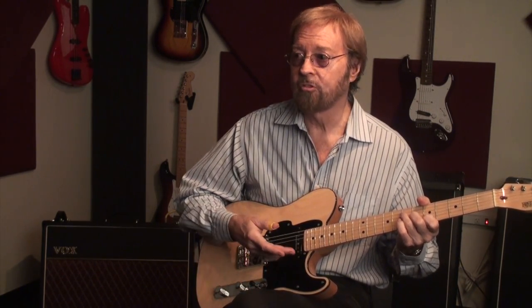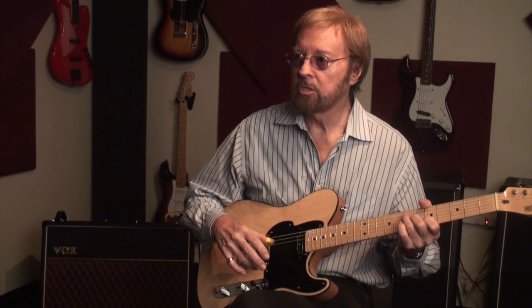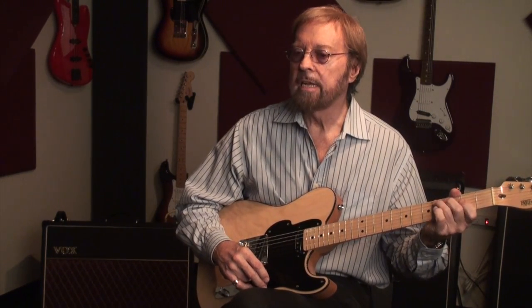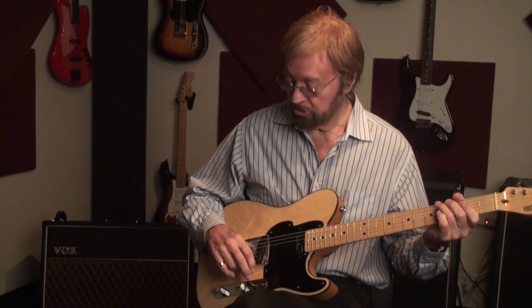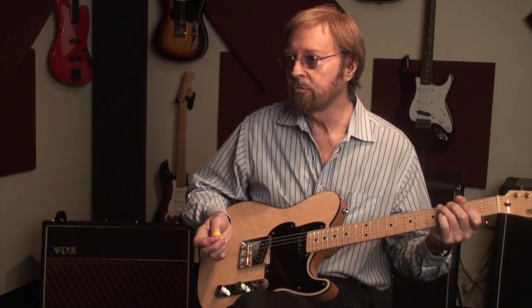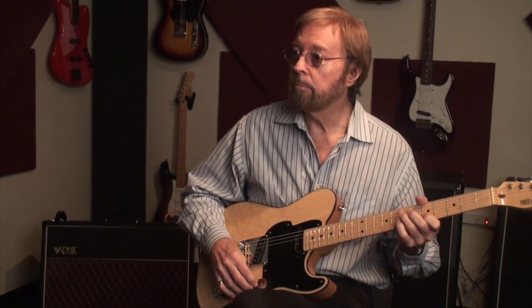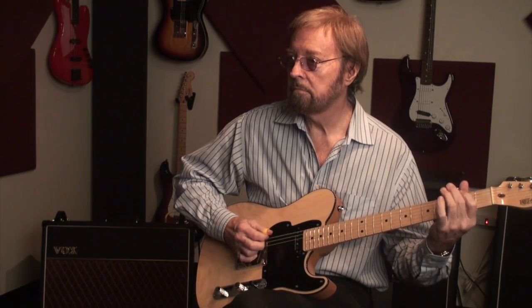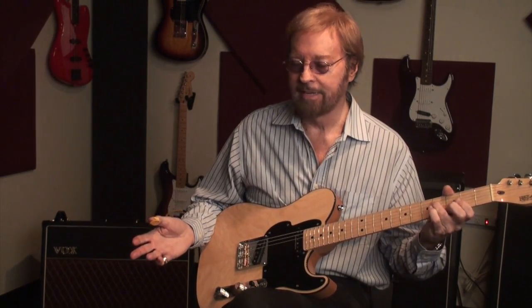He said, well, you can't as long as that cap is in the pickup. But he said, what we could do is get a super five-way switch, because a normal Strat five-way wouldn't have enough lugs and options. Wherever you want to access that sound on the five-way, we'll just wire the cap there on the switch, with the phase reversed, with the wires reversed, in that position only, so that you get that nice quack tone there. But when you go back to the middle, you get your normal sound back. So it's like I could have my cake and eat it too. It was unbelievable.